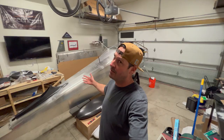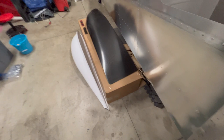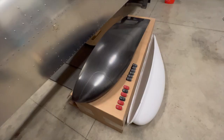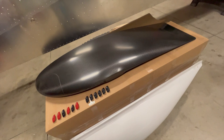The airplane is growing, it's almost on its legs. But let's talk upgrades. First off, check these out. Aerosport Products sent me the wing tips. You can see the difference in shape and how much extra trailing edge span you get out of these Aerosport Products ones. The other benefit is you don't need to cut a hole in your leading edge spar — you can just cut that out and put a landing light right there. There's also obviously a spot for the tip lights, which I've got the 3-in-1s: strobes, nav, and tail position light.